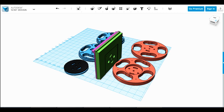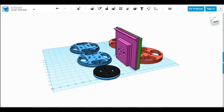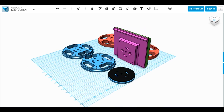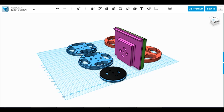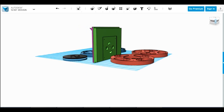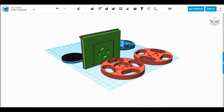The design has moved on rather a lot since the last part. The pieces we printed are these green and purple pieces - obviously they're all printed in white ABS. That makes up the plate which effectively fits between the top two rings and holds two bearings. I'm using these lazy susan bearings which aren't great vertically - they really want to be pressed down against the table with a turntable on top of them. So I'm using a pair of them which are actually going to be compressed together with studding - threaded bar - tightened up with nuts so it actually pulls them together. As far as the bearings are concerned, they think that they're flat on the table with a weight on top of them.